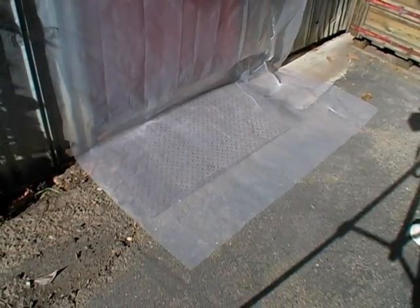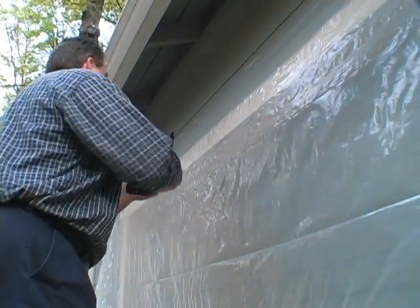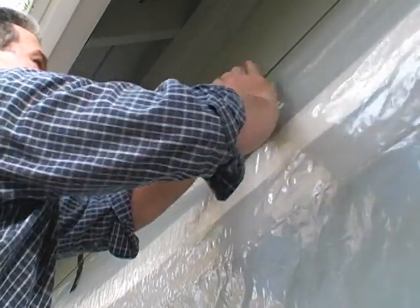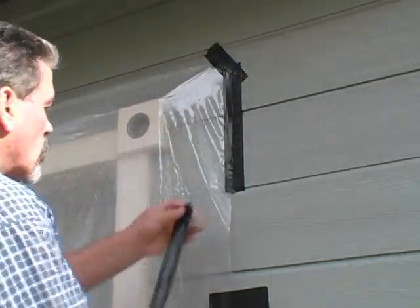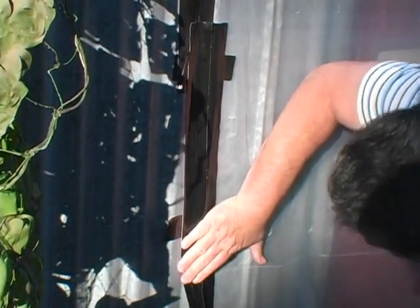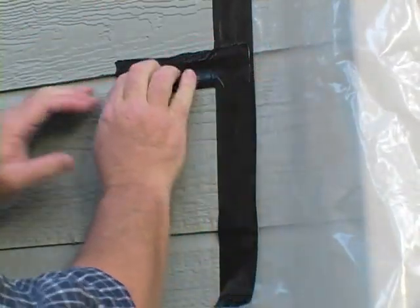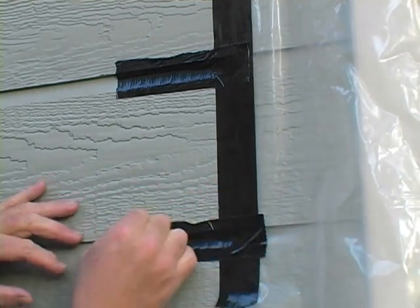Leave a flap along the bottom of the door of about 2 feet if possible. Step 4: Tape all edges. Now that the plastic sheeting is roughly in place, you'll use the duct tape to seal all the edges. Start by tacking down all the edges with strips of tape placed every 12 to 14 inches. Next, apply long strips of tape lengthwise along the edges of the sheeting, tightly securing the edges to the siding. Then go back and double it with a second layer. It's important to completely seal off any path for water or wind to get under the plastic, so take care to tape any crevices or laps in the siding. Firmly press down and smooth all taped edges for maximum adhesion. If you have enough tape left and the surface allows it, you can tape down the bottom edge or flap of plastic to the ground.